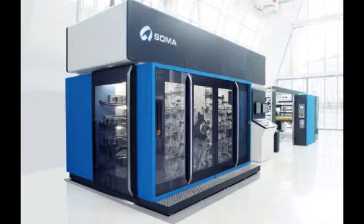Printing: A flexographic print is made by creating a positive mirrored master of the required image as a 3D relief in a rubber or polymer material. Flexographic plates can be created with analog and digital plate-making processes. The image areas are raised above the non-image areas on the plate. The ink is transferred from the ink roll, which is partially immersed in the ink tank, then transfers to the anilox or ceramic roll — whose texture holds a specific amount of ink, since it is covered with thousands of small wells or cups that meter ink to the printing plate in a uniform thickness. The number of cells per linear inch can vary according to the type of print job and quality required.